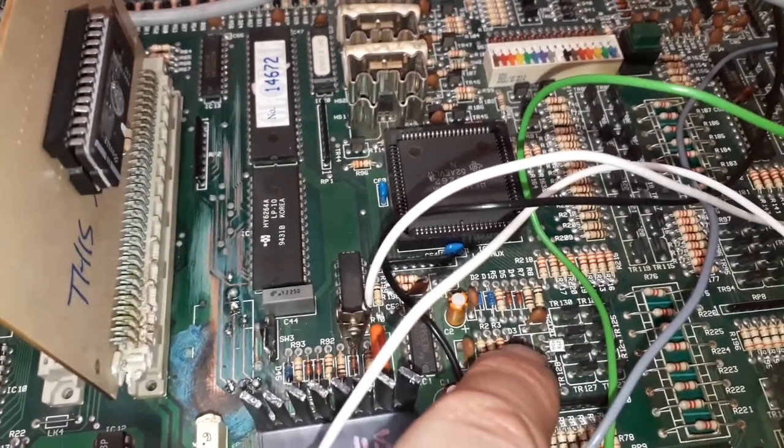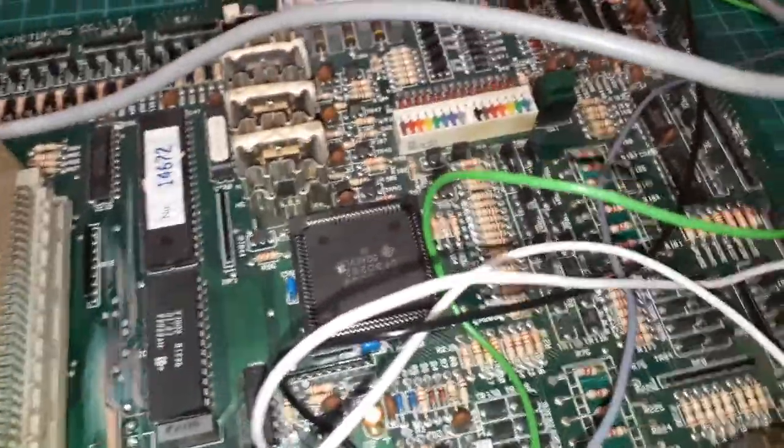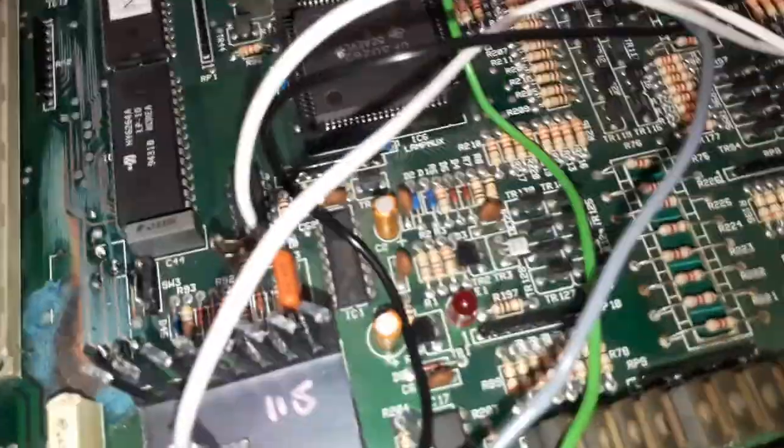This one here is the watchdog. If that isn't getting a pulse, it stops the board from working. But we'll get back to that later anyway. To bypass all that, you can simply bypass the reset by clipping onto the top of D7 there and grounding it, and it just takes the reset out. You can see this here, yeah, see, off. Anyway,